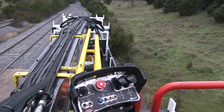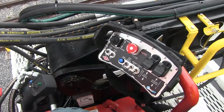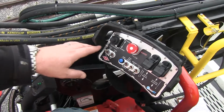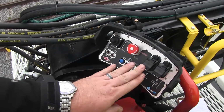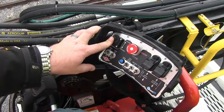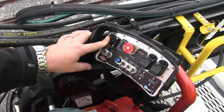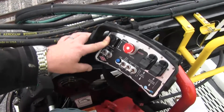Before moving the vehicle, check to ensure there are no obstructions in front of or behind the vehicle. Then disengage the PTO and set the throttle to idle. Apply the service brakes if needed to prevent rolling. Move and hold the transmission joystick in the intended direction of travel, and then release the service brakes as the vehicle starts to move. The operation of the parking brake, clutch, and shift lever are all automated.